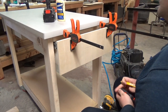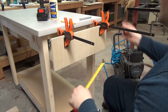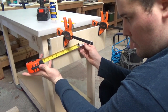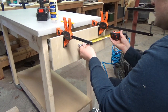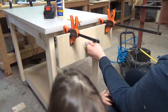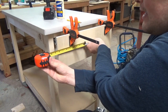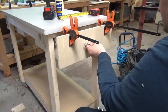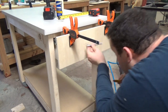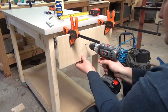I'll mark a horizontal line across there and then grab my handle. When this is centered, I should have eight and a quarter inches on either side. I've got a little helper in here right now — sweetie, can you go sit down for Daddy? Eight and a quarter on each side. Now I know where the handle needs to be. I'll put a vertical line in the center right at the horizontal mark, so now I know exactly where to drill my holes. I'll center up where those lines intersect and drill through.